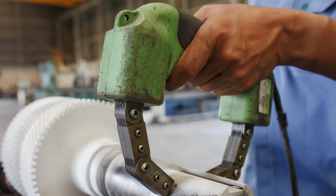So just an add-on to that, you're more susceptible to see indications using a yoke without taking your coatings off. But I did an extensive study on a part that had failed in the past, and the mag was being performed with a prod inspection through mill scale, and we were not seeing any defects. They took the mill scale off, which was in the neighborhood of 7 mil, and a 7-foot long crack actually formed with the fluorescent particles, but with the mill scale on there, we couldn't see anything.